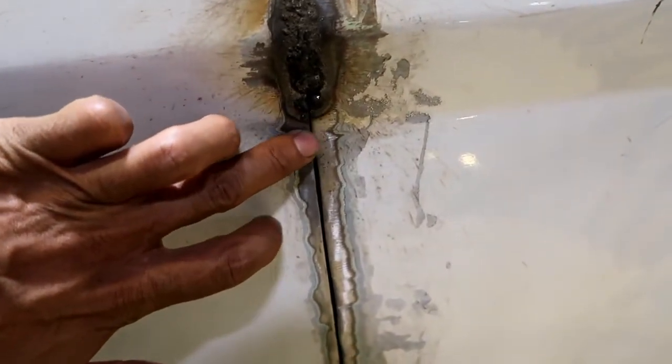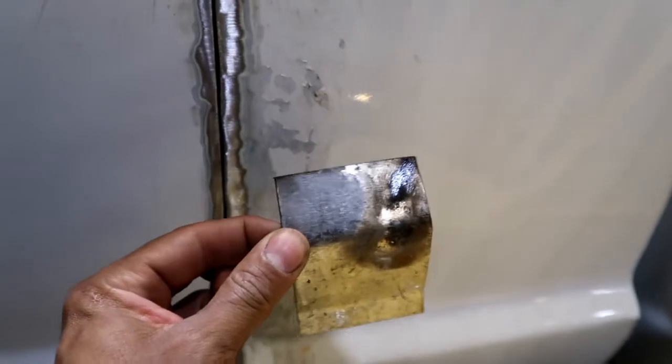I'm basically just gonna keep coming down here. I'm gonna see if I can get this little part here welded in. And then what I was doing with this piece here was just a scrap from the long bed. I'll stick it in, basically behind. I don't know if you'll see it peek through there or not. Yeah, you can see where it just turned light right there. That kind of helps with the blow through, as if you can hold this back here or have it held back here somehow. And then just kind of one hand with the welder and come down.